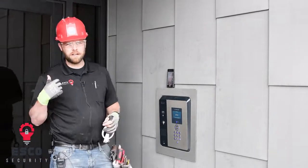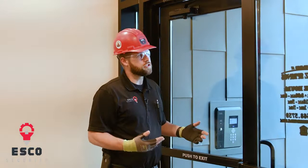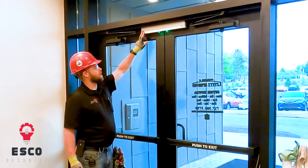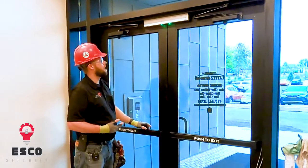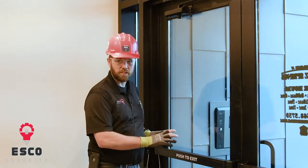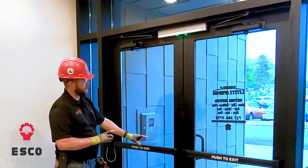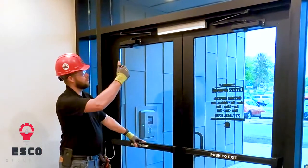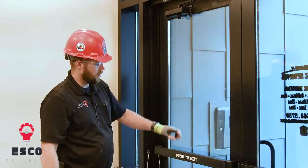Now if you follow me inside, I'll show you how the mag lock works. So here we are inside the door, just to show you what the hardware looks like. We have installed a double mag lock with status indicator lights that tell you that the door is actually locked. These are request to exit panic bars that are touch sensitive. So they just need a touch, and as you can see, the lights will turn off, and that will allow the locks to unlock and let you exit the building.